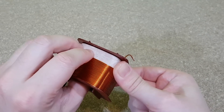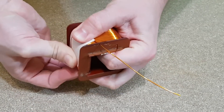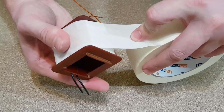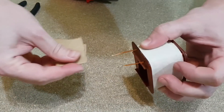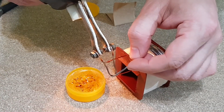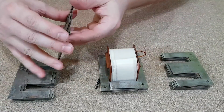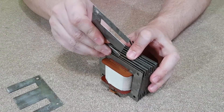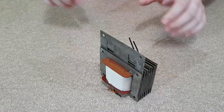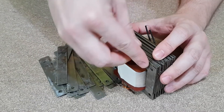It's important to arrange the wire very straight with all the turns one next to each other so you don't waste any space inside the transformer. I'll use a small piece of sandpaper to remove the wire insulation and prepare the wires for future connections. I'll use my old and trusty soldering gun for this thick copper wire. Now I'll just put back the silicon iron sheets — it's recommended to arrange them in an alternating manner, but when you're in a hurry you can group them in two or three pieces. The final two pieces will be the most difficult to insert; you can put them between two other pieces and use a hammer, but hit them right in the middle. If you insert the iron sheets at an angle, you will damage the bobbin. Next we need to insert the I-shaped pieces.